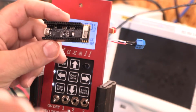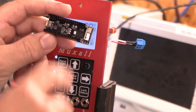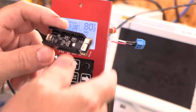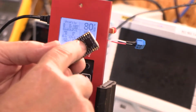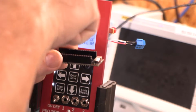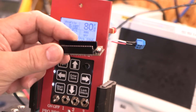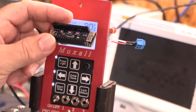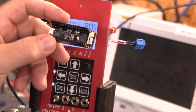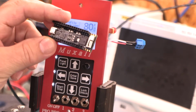If you notice, all the electronics and buttons are on the wrong side. So they put female headers on it and expected people to, I guess what they were thinking, they used to have rubber pads on the bottom. They expect you to set this on your table and then plug wires in the top of this to do testing. And that's fine and dandy for testing, but if you want to stick it on a breadboard, you had to use some male headers and plug it in your breadboard. Then you couldn't access anything under here, so it was a bit backwards.